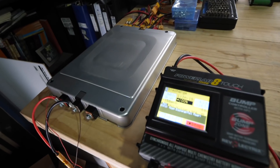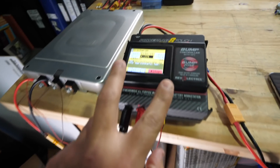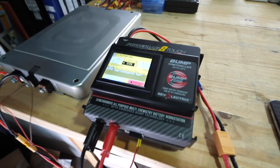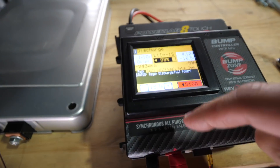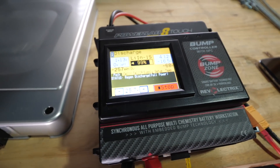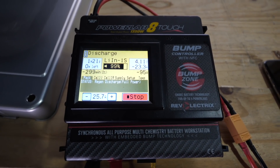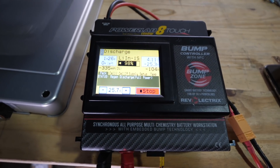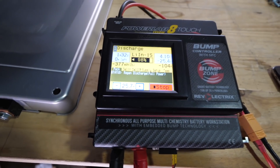Here's the setup. We're only discharging one cell, using this guy to discharge it, and that's a regenerative charger — we're putting that energy back in here. The reason I'm doing that is because it allows me to go kind of fast. I'm doing 16 amps right now. Let's do 25 — let's see if it'll go up to 25. 17, 18, 21, 23 — there we go, 24. Which is crazy because 25 amps only equals about 100 watts.